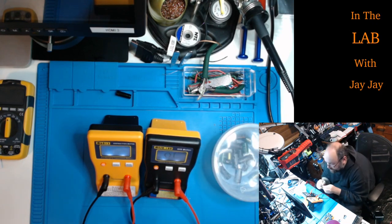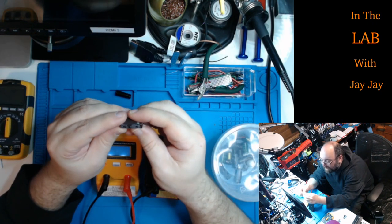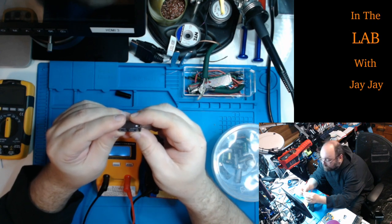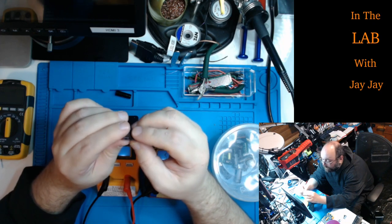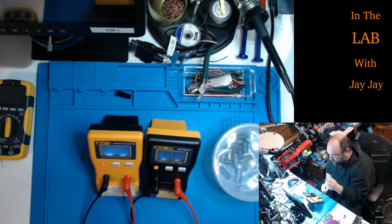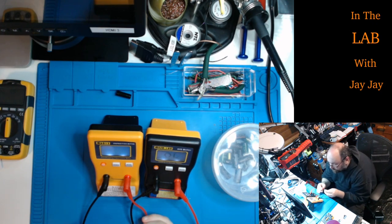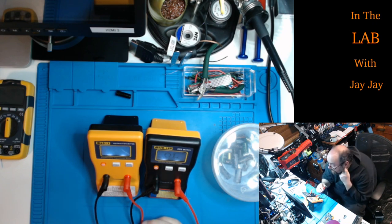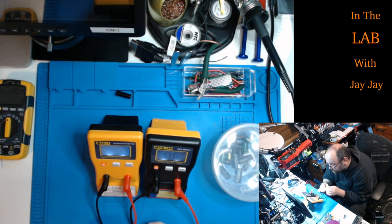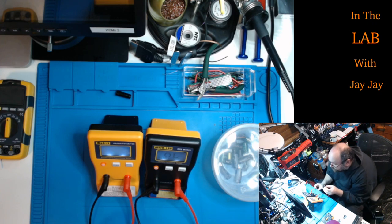So this is billed as a 3,300 microfarad 10-volt Nichicon electrolytic. So it's supposed to be 3,300 UF. So let's see. And it's reading in at 3,400 UF. So that is the correct capacitance. And now we'll check the ESR.